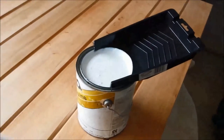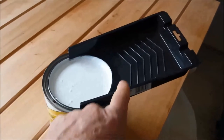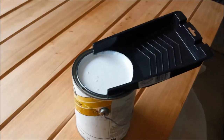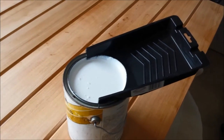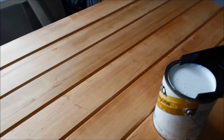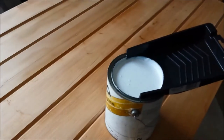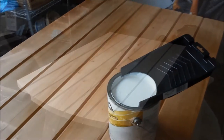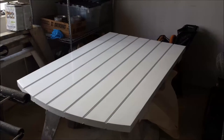Once the caulking is done, we'll put the primer on. Here's a cool little tool I found at the paint store — it clips on to a one-gallon can of paint. In this case it's my primer, and I can use it with a two-inch roller. Because this gate is fairly small I don't need a big roller, so I've got my brush to knock down the roller stipple and we'll get this door primed. I'm priming every surface on the door, even behind the hinges when they're cut and behind the handle when it gets cut, so that everything is sealed up good and tight before painting.